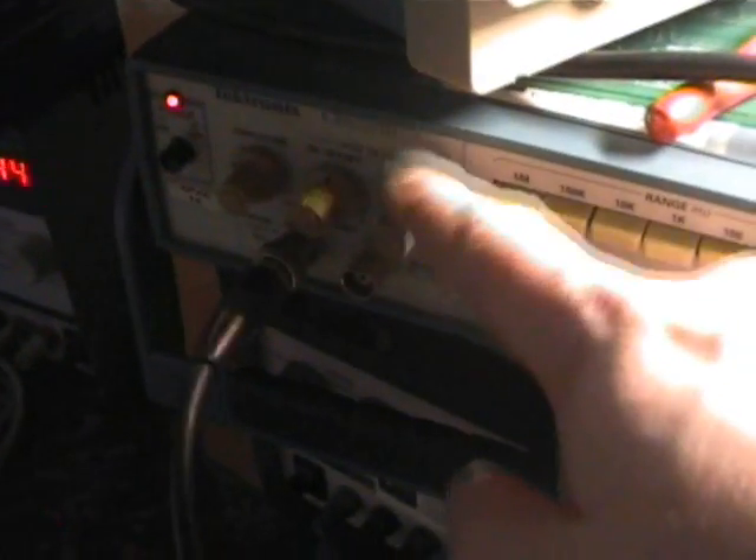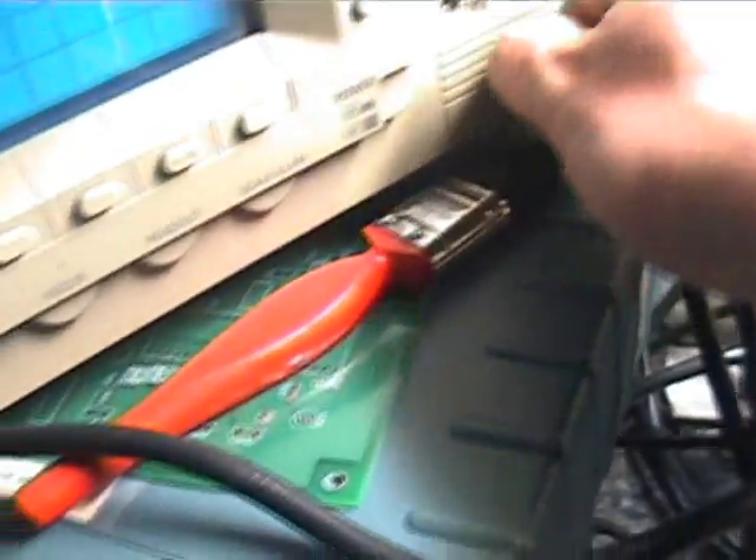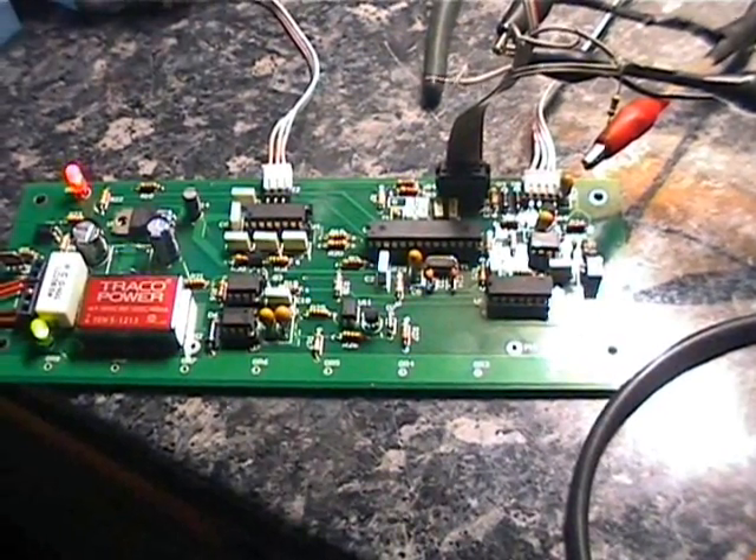The only concern I had was if I change the duty cycle. It's at 50% duty at the minute. If we go onto the oscilloscope, we're at about 50% duty cycle — it'd be better with the light off to see the scope. If I change the duty cycle and expand it a little bit, we're at about 2580 RPM. I might have to make a little bit of hardware that cleans up the duty cycle, because the RPM sender I have is probably not going to be exactly 50%. This is the first experiment, and so far it's looking very good — stay tuned for more.